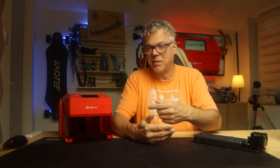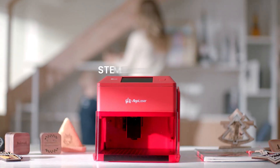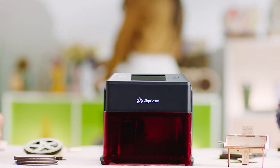I should note that the machine has a 5-watt head, which makes it suitable for cutting as well. True, you can't cut thick materials with it, but you can cut things like 3mm plywood, thinner leather and engraver paper, and similar materials. That's something at least.